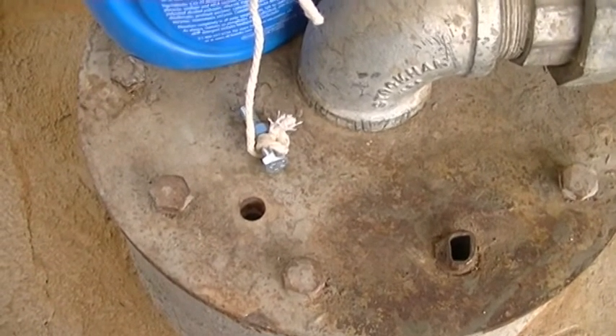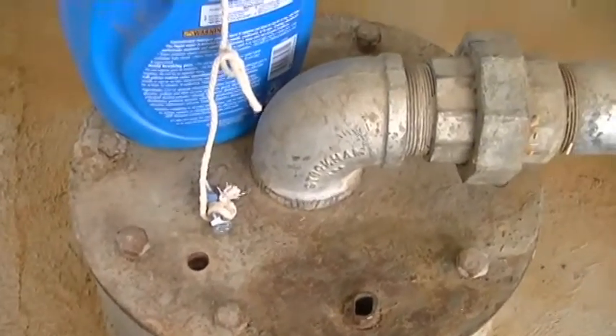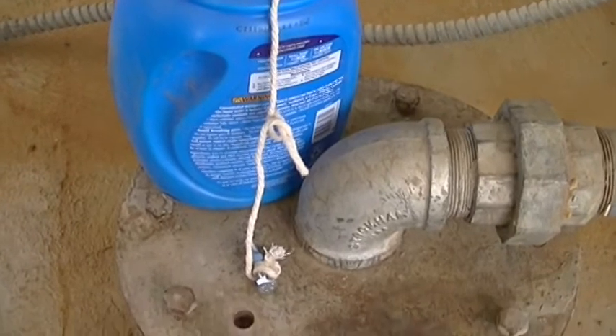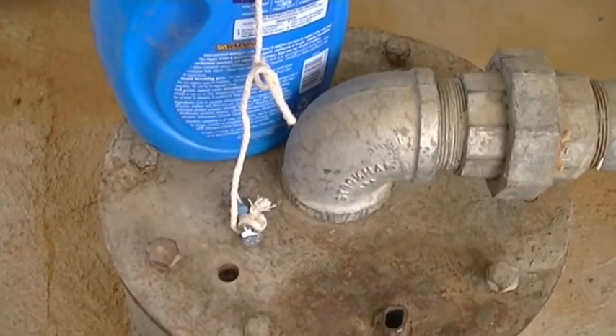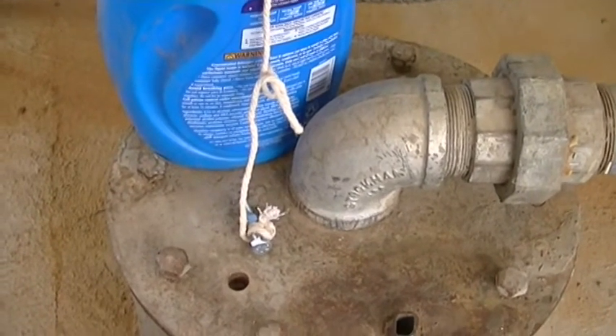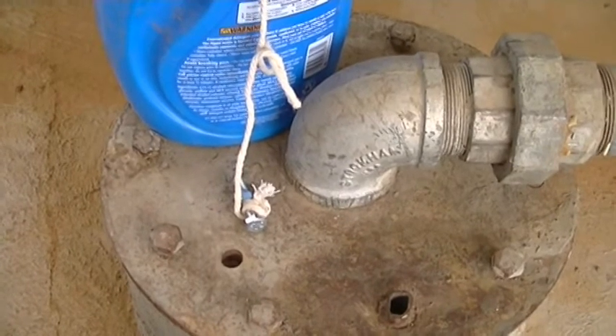At 70–71 feet, that gives me about 15 feet of water on top of my pump, and that's getting a little concerning. I will talk to a pump person and see what we can do, but I'll monitor this weekly to see where we're at. Since it fluctuated from 43 feet to 71 feet in a week's time, checking once a week will give me a trend.